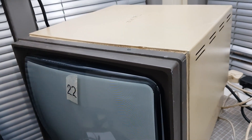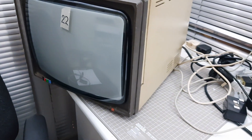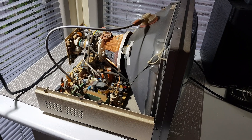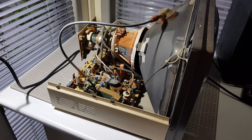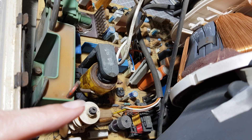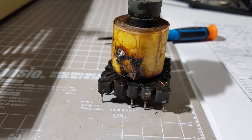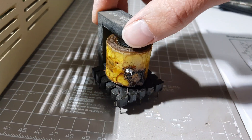I think what we need to do now is just turn it on and see what happens. Here goes nothing. The line output transformer worked, I also heard the degauss work and it didn't blow up - so that is a good start. After powering this up I got some EHT because I could hear it crackling, but I didn't leave it running for more than a fraction of a second because I could smell arcing. There are cracks in the varnish all the way around the line output transformer and it's tracked down to the bottom - this is probably why this monitor was scrapped in the first place. You can see where it's been arcing and the insulation layers are definitely past their best.